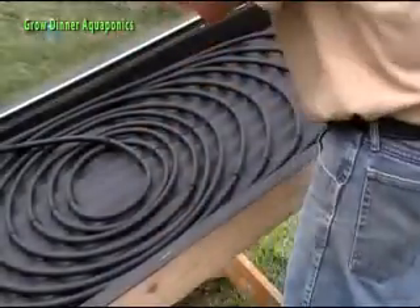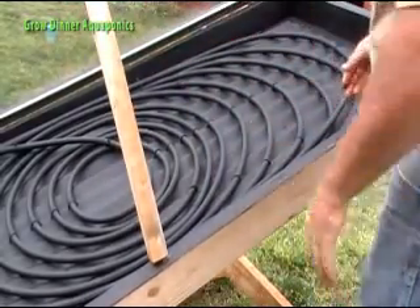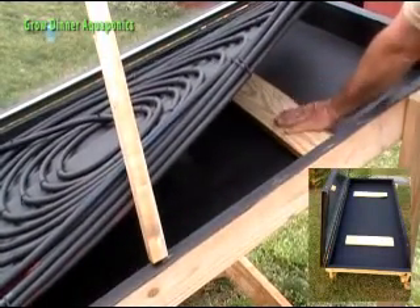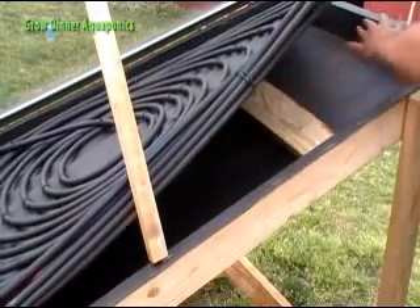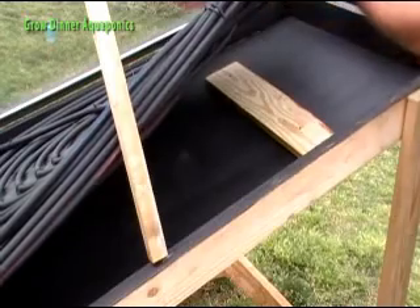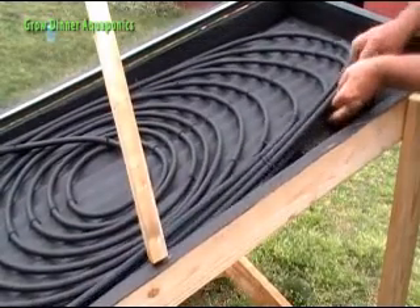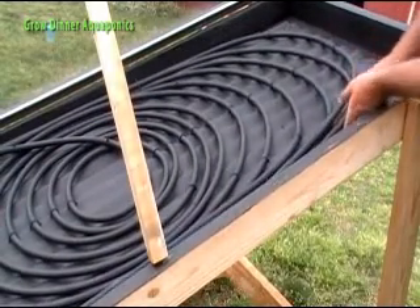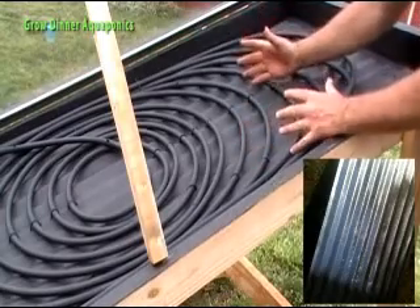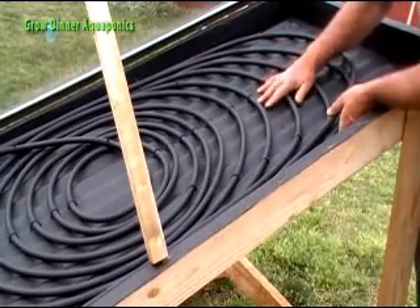Let's open up our glass panel and take a look inside. A small board actually helps prop it open — just stick it in there. Inside we've got a 1x6 screwed to the bottom to let some air circulation move around in our box. Then we've got PEX plumbing wound in the same pattern as the top. Then we have corrugated roofing metal — the corrugated waves help reflect more sunlight and draw more sunlight to your PEX plumbing. A piece of flat metal will not give you the same effect.